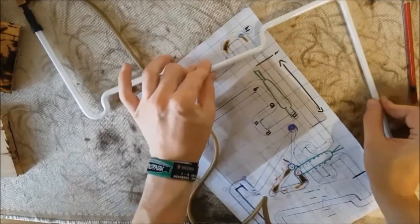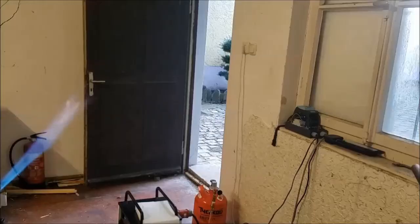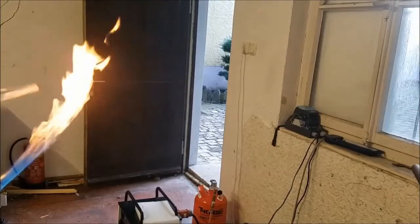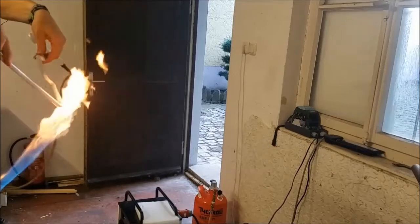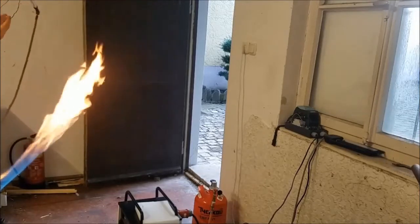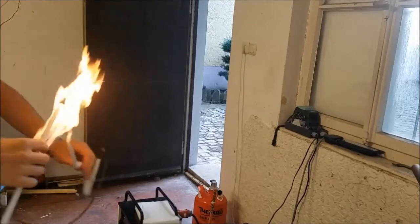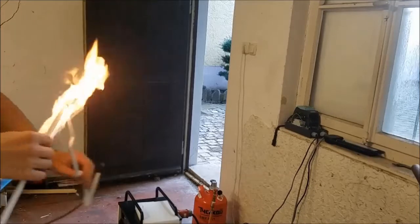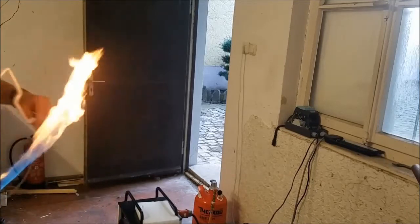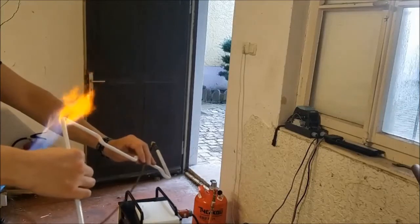This bend came out ugly. I'm not sure why. I think I might have forgotten the cork in the end of the tube, so I couldn't blow it out. Because I was already running low on that glass, I didn't start off again, but tried to save this bend. Just heat it up, work it out a bit more, and make sure it doesn't crack. It's not beautiful, but you can often mask minor issues, beauty issues like that, with the blockout paint.